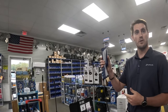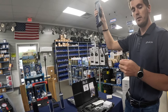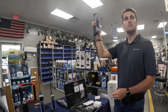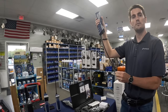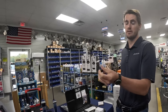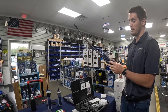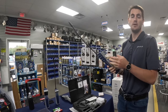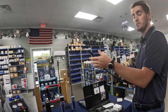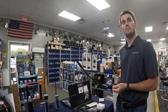Now if you're sticking this in a puddle, I wouldn't recommend that — but sometimes it happens, like at the bottom of an evaporator. If you know that does happen, we recommend you turn it off right away, let gravity do its thing, hold it upside down, take your cap off, take out the filter, wick out your cap, slide a new filter in, and you should be fine. But if water does get in, it can kill the unit — it'll get into your sensor and destroy it.